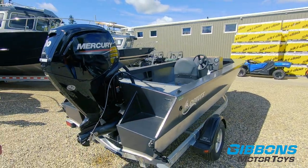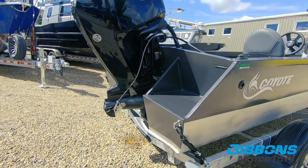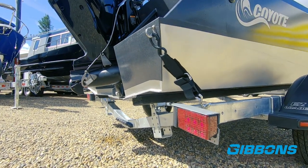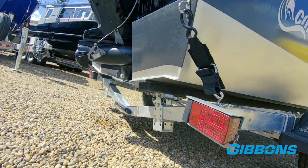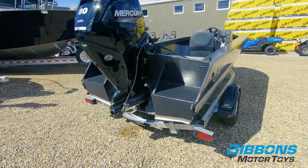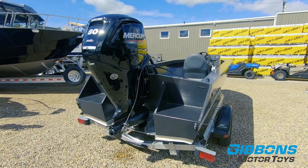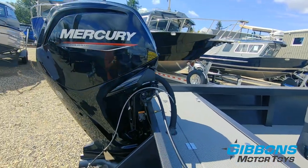As far as the hull bottom, Coyote uses a 10 degree bottom on all jet boats. The 10 degree bottom is what they've found makes the least amount of compromise in most situations — it's going to run very shallow, stay on step at slow speed, and it's still very drivable. When you steer it, it's going to steer well. You can get it to be slippery if you want, but a little counter steering at high speeds corrects it, making it a fun boat to operate.